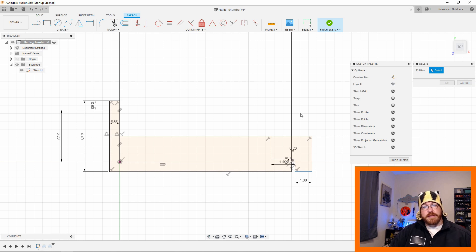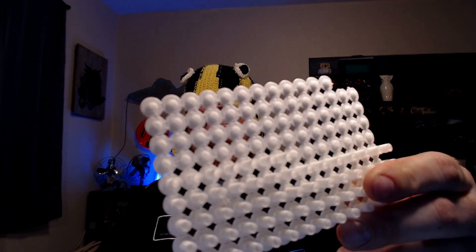You can see there's a whole bunch of these — these are printed at 0.08mm layer height. What I did is the very first layer that creates the brim keeping them all together is at 0.2mm layer height, so the printer sets there and then variable settings takes it from 0.2mm down to 0.08mm all the way up to the top. I do this for a couple of reasons: one, the printer likes it a little easier, and two, when you've got really small dimensions like this you need proper clearance so they snap together.